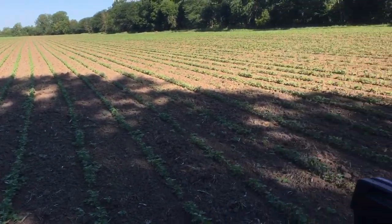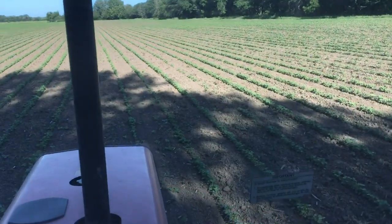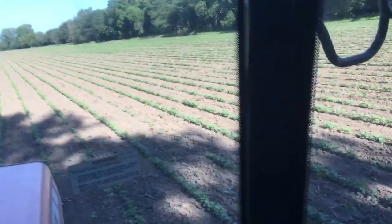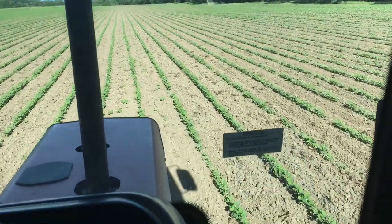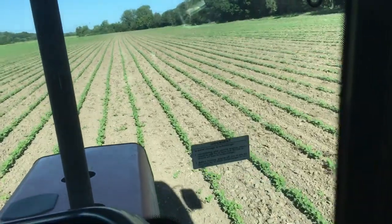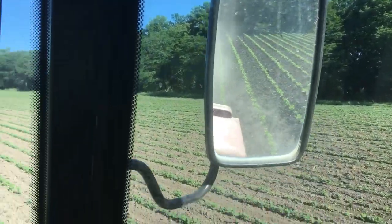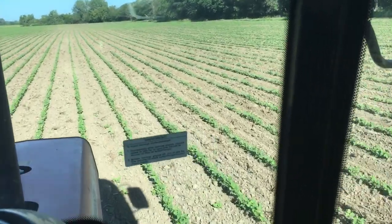Let's run just a little bit. I think I've already made these points, but when you have that narrow gap — this is the spike cultivator or prototype cultivator with the 10 and a half inch gap — you really need to know where you're going. I am not looking back; by the time I turn my head and turn back forward, I would be off the row. So once again you're left with looking in your mirrors. You can glance at your mirrors real fast. Starting and stopping does not give you an adequate picture of what you need to know — you need to know how the cultivator's working in process.